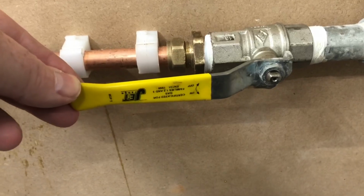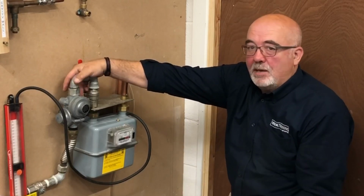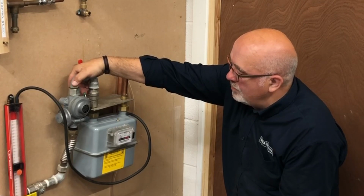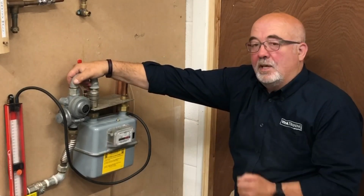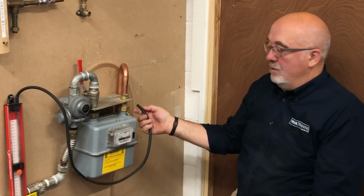Now this is the tricky bit. It's always the tricky bit. You've got to raise the pressure to the conventional 7 to 10 millibar, and what you've literally got to do is just touch this backwards and forwards, touching it until such times as it just lifts enough to get to between 7 and 8. See, very quickly you can go past it. No problem with that. You just release the pressure and do it again.